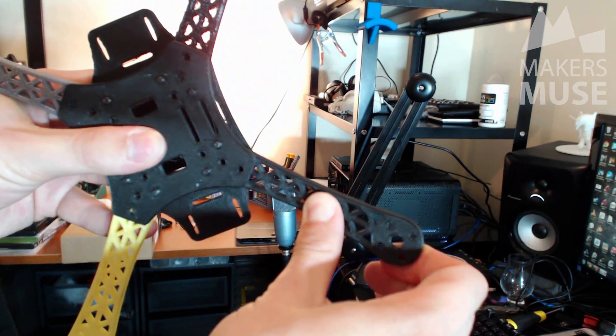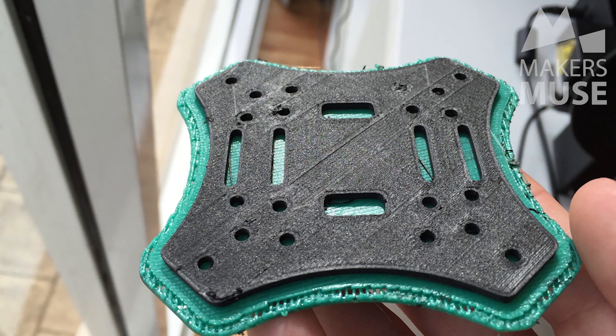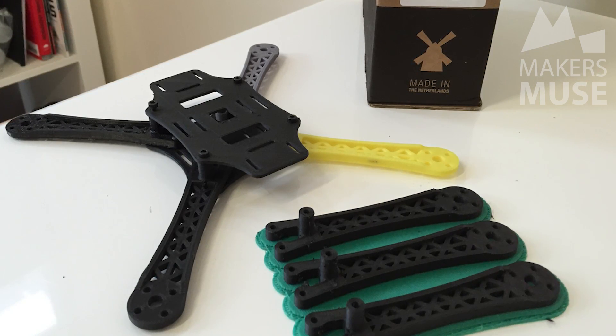In terms of printing, it's actually really easy to print. This whole quadcopter frame was printed on the FlashForge Dreamer with settings in Simplify3D. I printed a lot of these parts with an ABS raft — with the exception of the PLA print, which was done with a PLA raft — but the ABS part, the carbon fiber, and the TPU were all done with ABS rafts, and it works really well. I'd print the TPU quite slowly because it's very flexible, but at the same temperature as ABS — about 230 degrees.